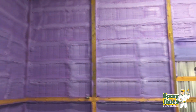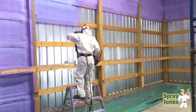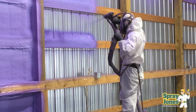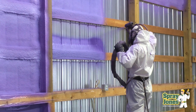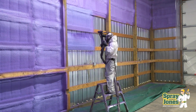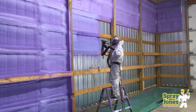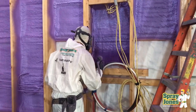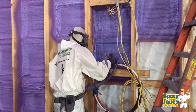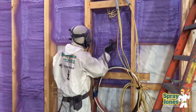If you don't have a solid backer, you could push the plug cutter right through the foam and through to the other side, cutting a hole in your wall. So you can cut the membrane and have it very difficult to test the spray foam's adhesion in the first place. These are the top two reasons why suppliers don't rate and don't advocate their products over Tyvek. We have used Tyvek in construction a lot — we don't like it, we try to have people avoid it. We prefer things to be solid: cardboard, plywood, or metal. Tyvek's biggest problem is that if it's not restrained it will shift, twist, and pull through staples or screws. Will it stick to the actual material? Absolutely. Will it stick well enough to work? Absolutely.